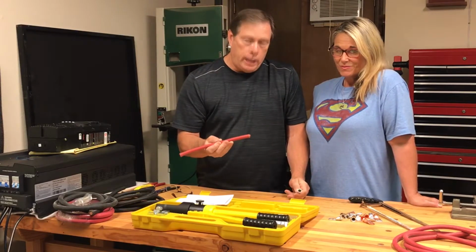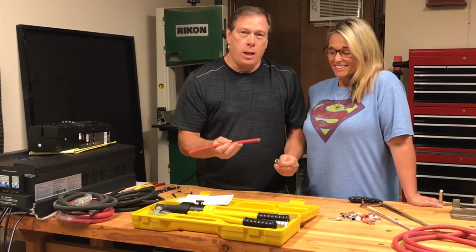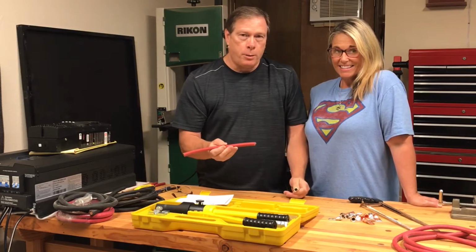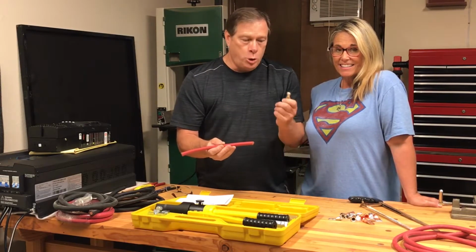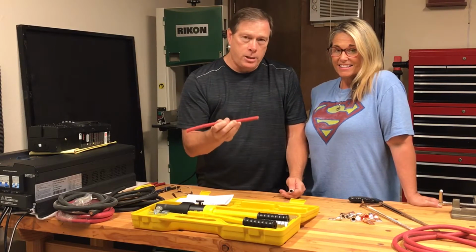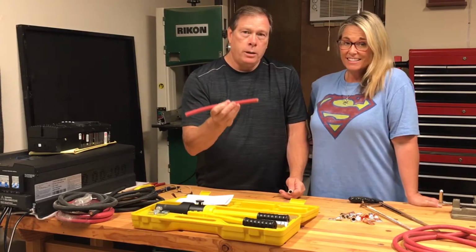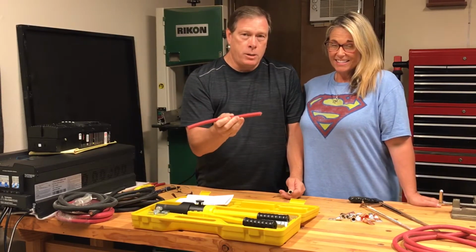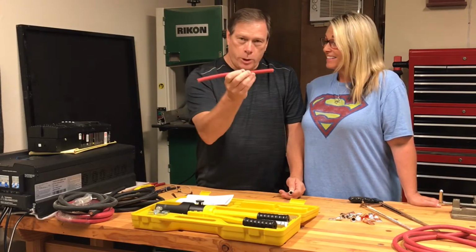electrical connections are solid and secure. And that means making sure you've torqued everything down properly where it needs to be torqued with a torque wrench. It means making sure that you crimp and solder all of the important connections, because the last thing you want when you're going down the road is for a high voltage wire to become detached, or for resistance to build up in a line because it wasn't made properly and cause a fire. So anyway, we're going to show you how we do this tonight.